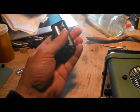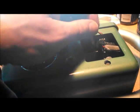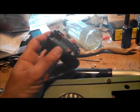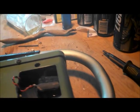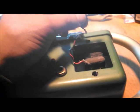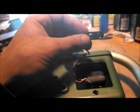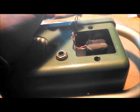see, it goes in these little four packs, but it's got a 9-volt connector. Common problem with these older units was that people would get them from a yard sale or something and not have these four AA battery packs, and they would see the end on there like that and figure, oh, needs a 9-volt. So they go and throw 3 9-volts in there, okay, which is technically almost 30 volts when it's only supposed to be 18. So you overpower the unit and starts burning stuff out.